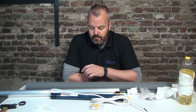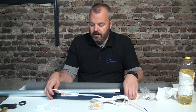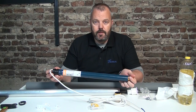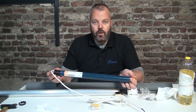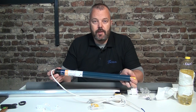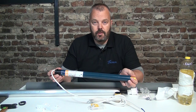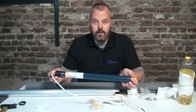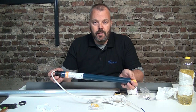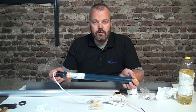Hi guys, it's Otto here and today we're going to assemble an electric roller blind based on a kit with a Sonesse RTS motor. It's a Sonesse 40 RTS, which is very useful for larger electric roller blinds. You have a WT edition version which is a wired system and you have the RTS version. If you want to use a remote controlled version, take the RTS one. If you have your own control system or want to use a switch, then use the WT one.